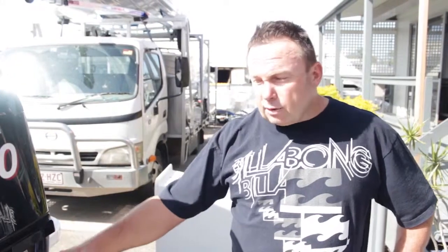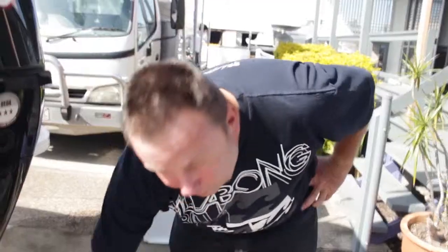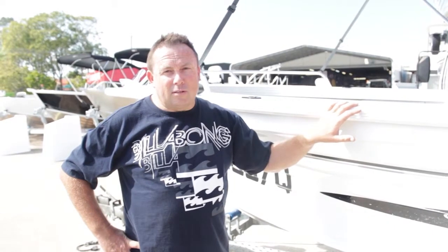Another good check - you'll notice if we go down to the propeller, the last exit point in most outboards would be water flowing out through the propeller. It's quite common if you run aground into a sandbank and pick up a bit of grit, you'll actually block the telltale. A simple easy test out on the water before you panic is to trim the motor up, start it up, and make sure the water's circulating out through the bottom of the propeller. You probably haven't got a problem, just a small blockage that needs to be cleaned out with a bit of wire or an air nozzle. Make sure you restart the engine and check that it's re-pumping water through the telltale. So that pretty much concludes this section on the different parts of a boat for our theory session, and we hope to see you soon in one of our classes.